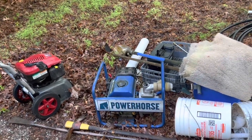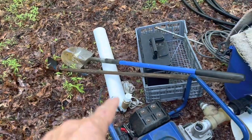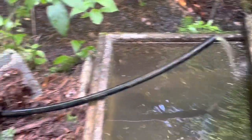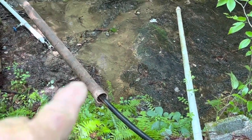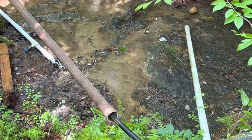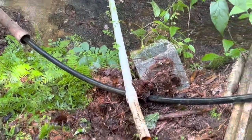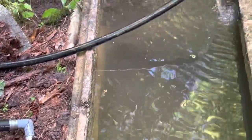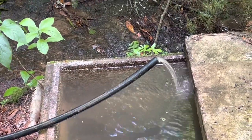Over here is the pump I've got all put together. We're going to put that in the tank and get it wired up and hooked up. There's the water coming out of the spring by way of the brand new pipe. I ran in this piece of heavy steel pipe as a bridge instead of all the sagging with PVC pipe. We're going to get it coming into the tank on a constant downflow. The spring is flowing pretty good right there.